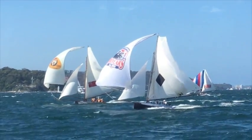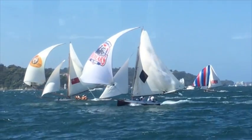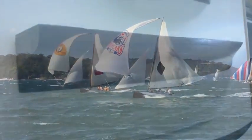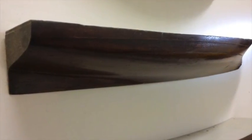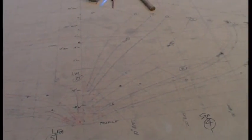I built Britannia over 15 months in 2001 and 2002. Aussie open boats were generally built from a half-hull model. I had the luxury of a full set of plans drawn from the original boat by Allen and David Payne for the National Maritime Museum. Either method still requires lofting, or drawing the plans out full size.